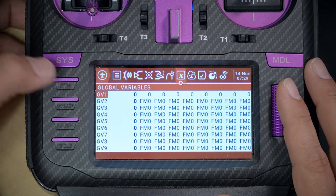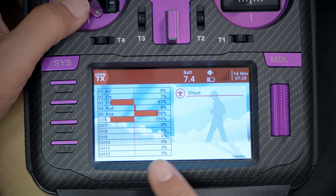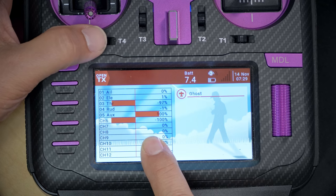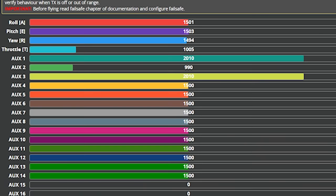It is working. And if we go back out, we can see that channel 7 is — oh, we've got a problem. Inside the radio the channel can go up to 1024, but in Betaflight that's not going to work. Looking at the receiver tab, it's going up to a maximum of 2010 and just staying there. We have to keep it within the 1000 to 2000 range that Betaflight expects.